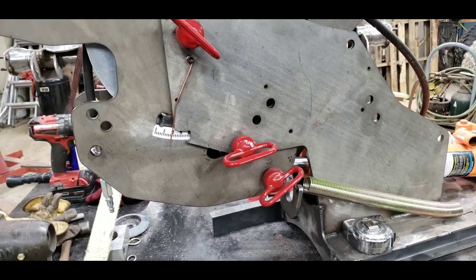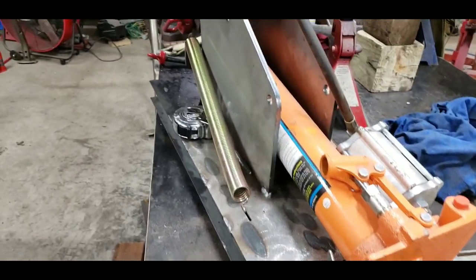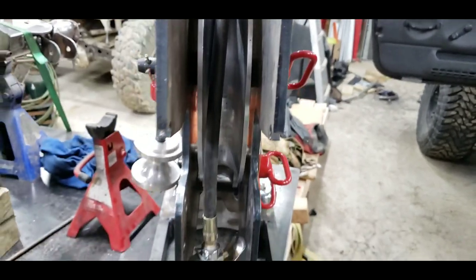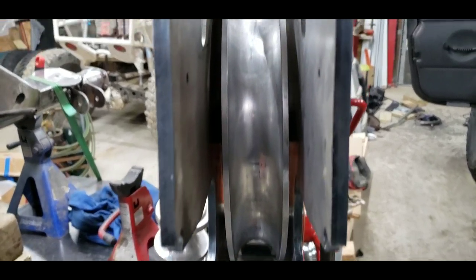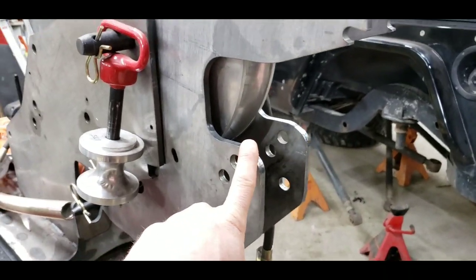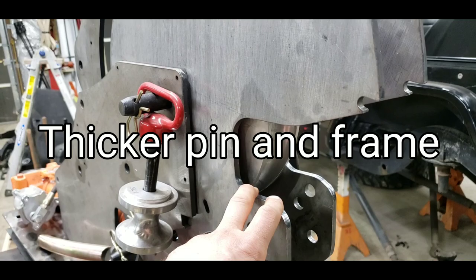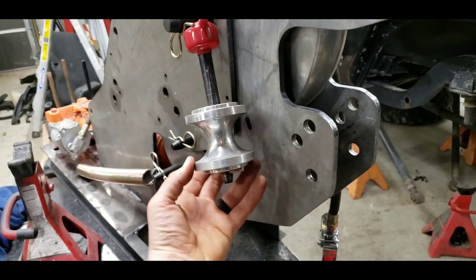It works for me. I can't say that I'm unsatisfied with it, but it doesn't quite bend the way I wanted — it's putting a bit of a flat back on the tube. I tried a couple options, talked to Rogue, tried to see what sort of options were available to eliminate that. I have the extreme heavy-duty setup, so I have the upgraded center pin and the bigger round pieces, and I also have roller dies rather than feed-through dies.